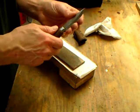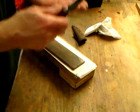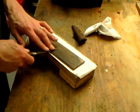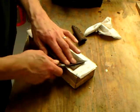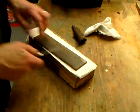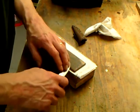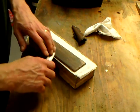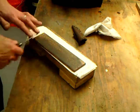This is pretty good. In my experience, it's better to have this slurry a bit too thick and thin as needed. If you start out with it too thin, you won't get very good results — you'll have a hard time grinding and a hard time removing the burr.